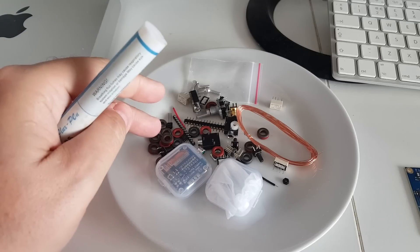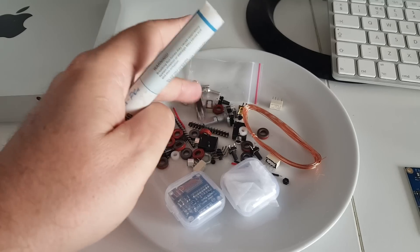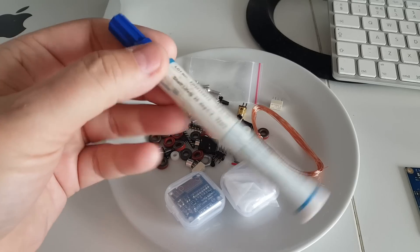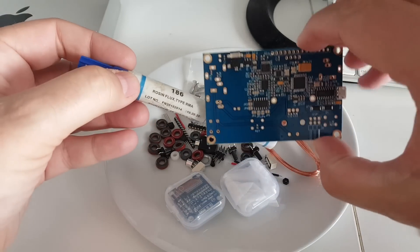I'm really hoping it's going to work, because this would make an awesome prepping radio — small with SSB, CW and digital modes. That's absolutely incredible. Low power consumption, a built-in speaker, I think a built-in microphone, and a built-in morse key. You could almost use it as a handheld. Except for the toroids, there isn't much to it — relays, connectors, buttons and that's about it. By the way, I'm using a flux pen; it really helps for soldering on very small soldering pads.